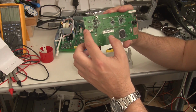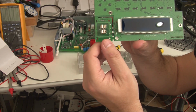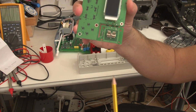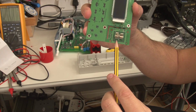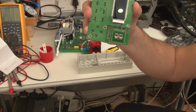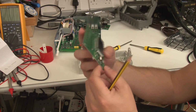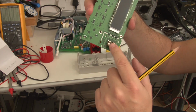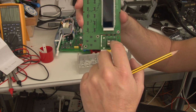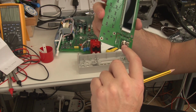And that circuit at first glance didn't make sense until I had a look under here and got down and looked very, very closely. I don't know how well you're going to be able to see this, but if you look down in here, you can see just underneath there is actually a chip. So my guess is that's a thermocouple controller, and that chip is thermally coupled to these two pieces of metal, so when the thermocouple plugs in, they make connections here, but the temperature of this metal here is reflected on the top of the chip.